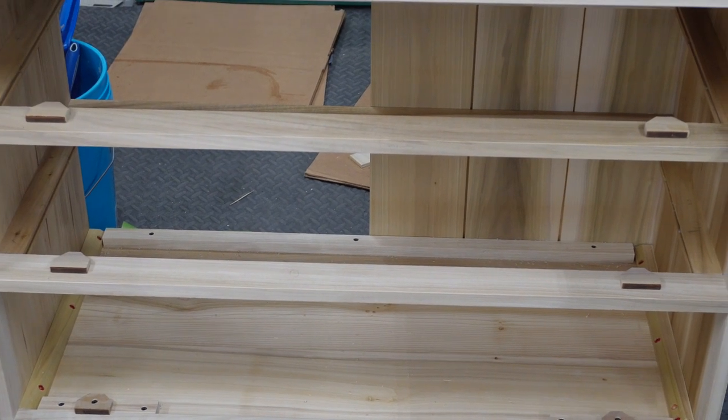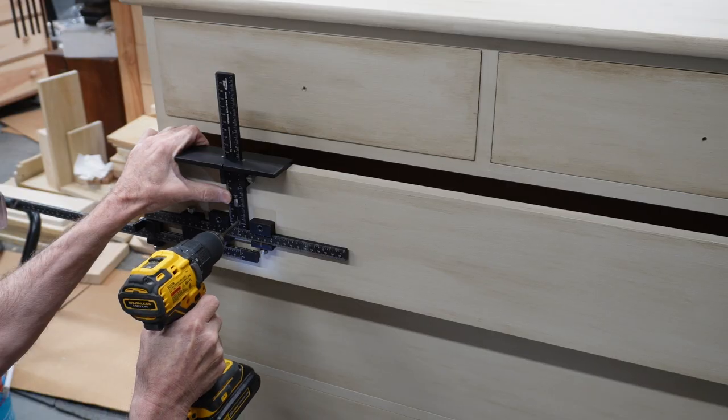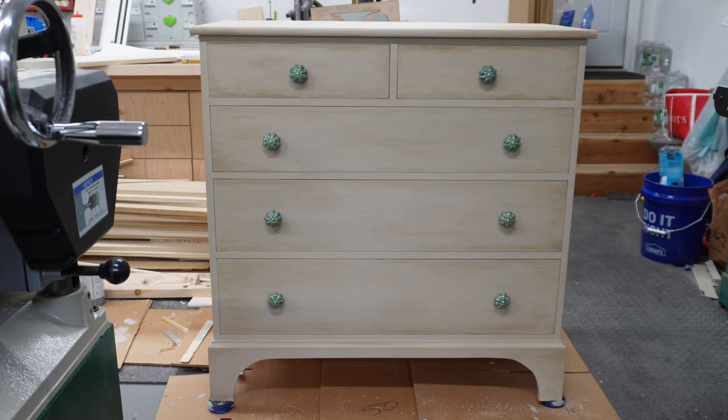The back of the carcass is half-inch poplar tongue and groove, attached with screws top and bottom. The next step was to install the drawer knobs, and for that I used a cabinet hardware jig from True Position Tools, which made really quick and accurate work of the installation — above and beyond other jigs I've used, so if you have a lot of cabinet work this is definitely worth a look. Here's the final product. We used a combination of paints to get to this color so it matches the other furniture in the room, and a darker wax to give those darker accents. I'll leave a link to the Epic Woodworking website where you can purchase the plans — he's not sponsoring this video, I purchased the plans with my own money, and I have to say they were great. Thanks for watching and I'll see you next time.